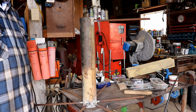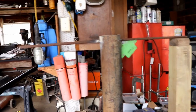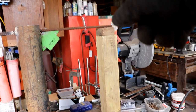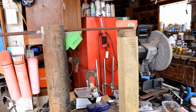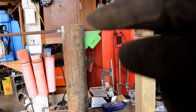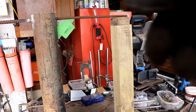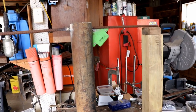It's going to work out really fine. I thought I'd show you my little jig for welding this up. I just had that 4x4 block right there with a little thin piece of wood on top — it's just a spacer to make it work out to the length of the pole. You can see there I have an angle magnet right there that holds that rod coming out, which will eventually hold a house. Now I can weld it right there at that joint.